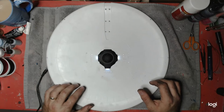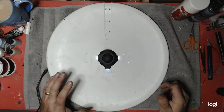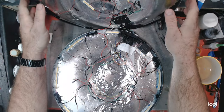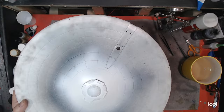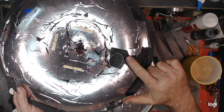I think I am going to work on getting the impulse deck finished, and that way we're getting close to being able to seal this up. I do want to put one more SMD in the back just to give it a little light coming out the back. That's going to be a real quick and easy fix. Alright guys, so I've got this pretty much all done and ready to seal up. That lower sensor dome is in place - it's all painted and ready for detailing for the Aztecing. Everything's sealed up. Don't forget, you do have to drill a hole to run your wires through. I drilled mine just a little bit forward of this hump in the back, just behind it, so I know I've got plenty of room with these pegs. The wires won't be in the way of anything once I put them in there.